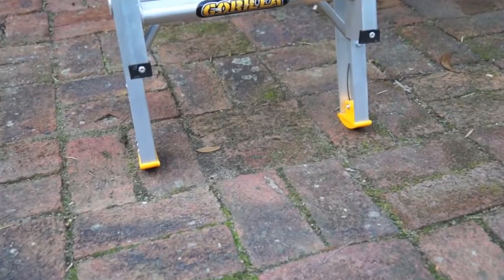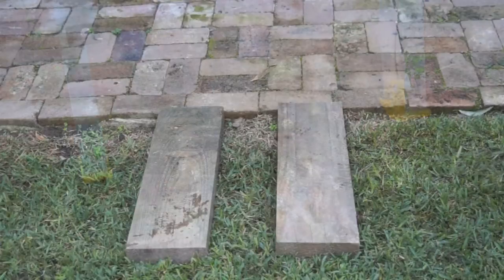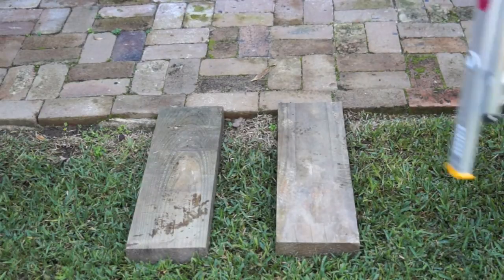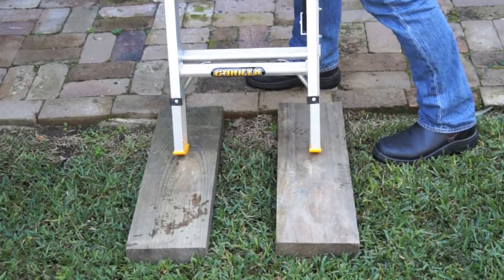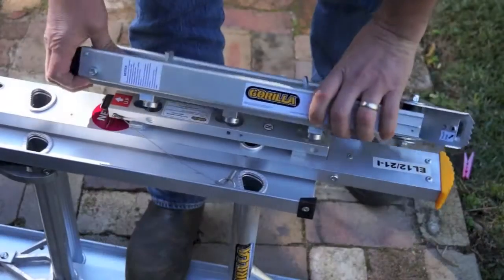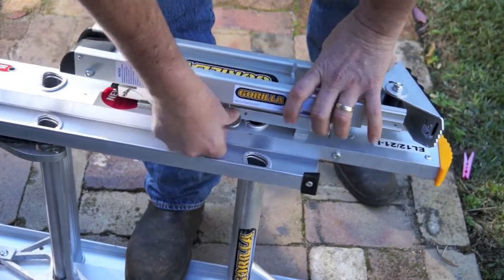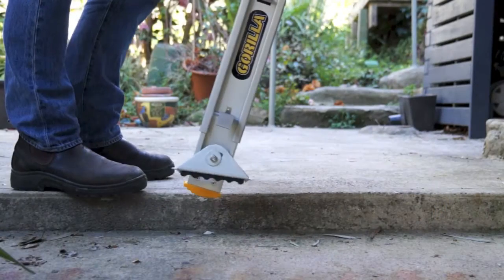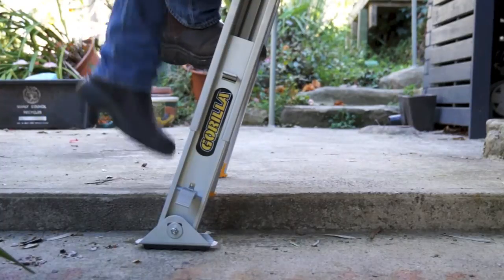It's important where you stand your ladder too. The ground needs to be level, stable and not slippery. If you have to set up on soft lawn or soil, put blocks underneath. Nice wide ones that won't roll over or slide out. That means no bricks. I keep a couple of sleeper offcuts for just this purpose. Sometimes you've no choice but to set up on uneven spots like a step. It's then that this doodad is your friend. It's an adjustable ladder leveler and it can attach to the stiles or legs of some ladders.